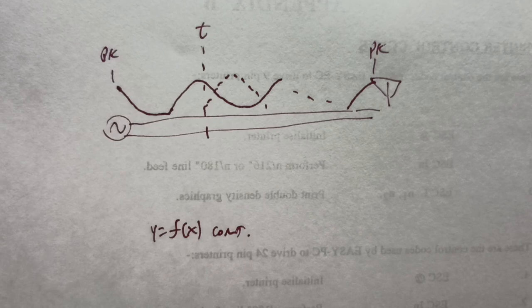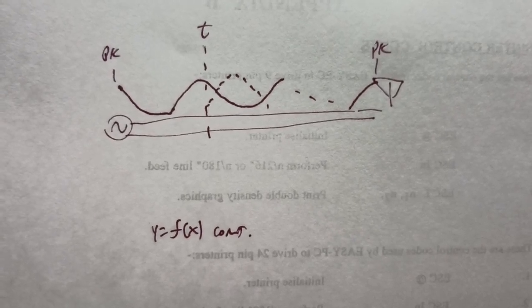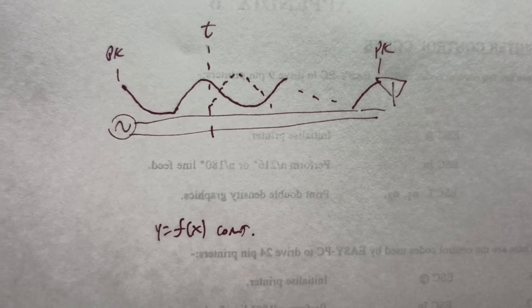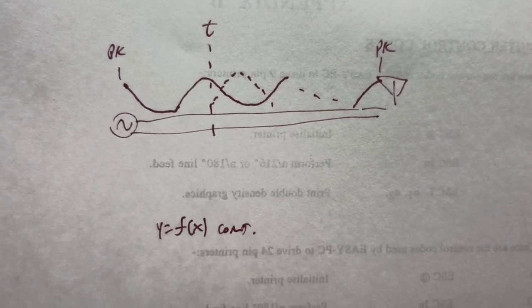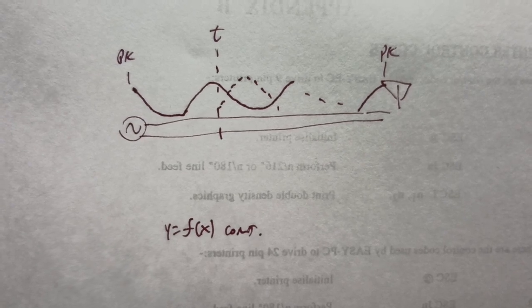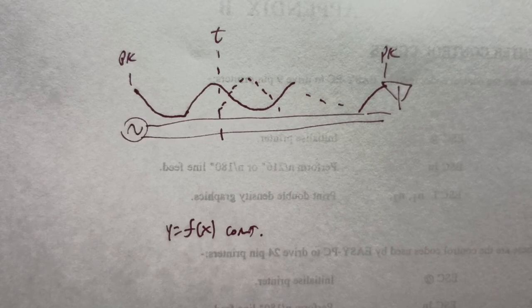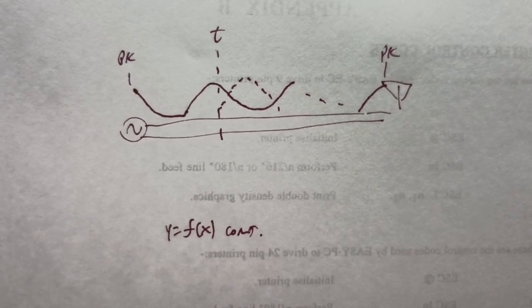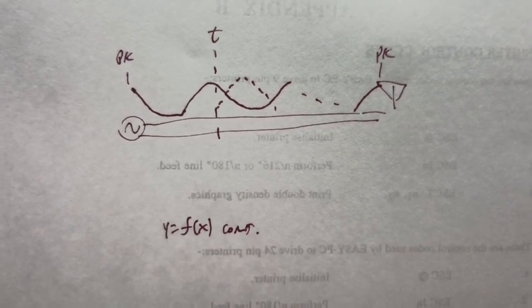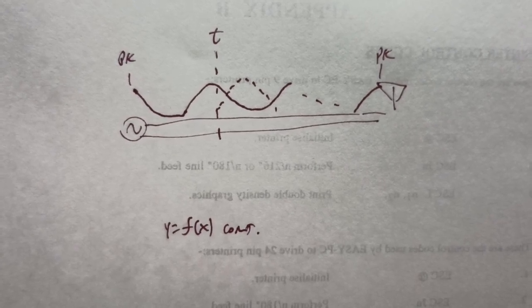And about the only time it matters to get it any closer is when using stubs. But that's another band-aid for use where there's nothing else that can be done, like AM broadcast towers or inaccessible antennas, or antennas that can't be modified. So there's the skinny on getting the exactly correct transmission line length.